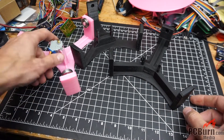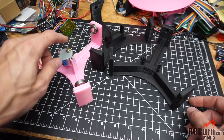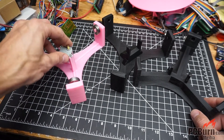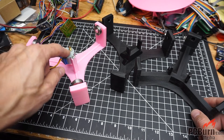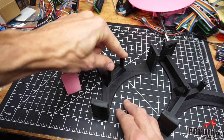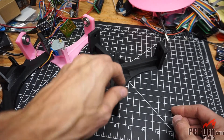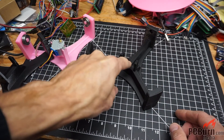This was the Pinky PLA — it worked great, came out fine, but there were some design problems. The table flexes quite a bit; you can see it moving up and down, which throws the bearings off so the tray doesn't sit on them flush. I redesigned it with a slightly thicker baseline but still had the same problem. Eventually I just added some huge supports between the center and each bearing post to provide structural support, and that actually works fine.